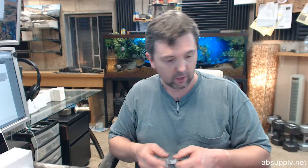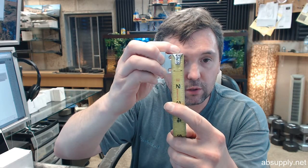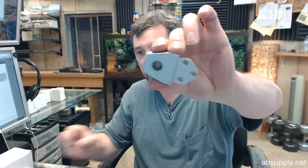The one dimension I didn't give you from the top piece is the center of those two screw holes — about 3/16ths and then down to about 15/16ths. Screws are included for the top portion: you cut the slot into the header, this slides in, and the countersunk holes go right into the tapped holes at the top of the header.